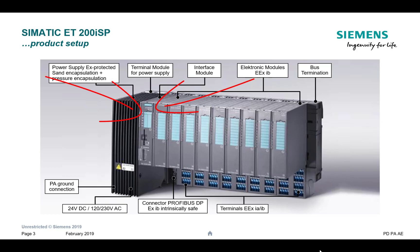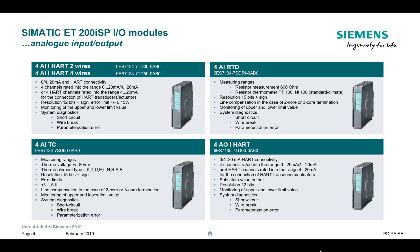What we have to do is configure this because it sits in a stainless steel enclosure and it's pre-approved, so that's the bit where we've got to be careful. When you spec the cabinet size, you can specify spare modules — which is well worth doing because we always run out of I/O on projects. If you put the spare module in, it's already certified, so you can slide in analog input modules and wire them up. If you purchase the right box size, the cable glands will already be there ready to go.